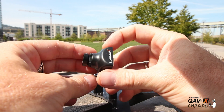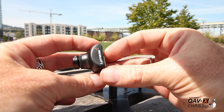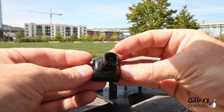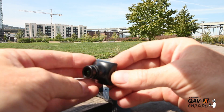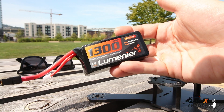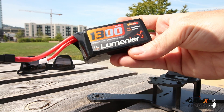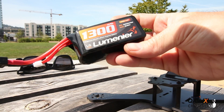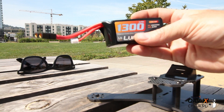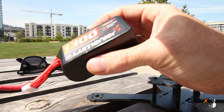The camera for my build is the new Lumineer — it's a CMOS 16:9 at 1200TVL. I'll let you know how it performs in the full review, but it fits nicely because it's the same average size as the HS1177 and RunCams used on these frames. Last but not least is the 1300mAh Lumineer graphene battery — it just came out. It has an 80C discharge and 160C burst rating, it's a 4-cell 14.8V pack with a black XT60 connector, so very compatible with all my charge leads.